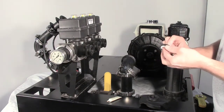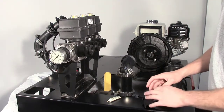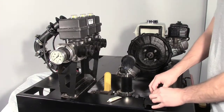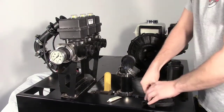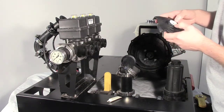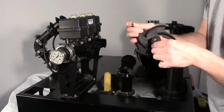Press the seal half into the hub of the impeller using even force. Be absolutely sure that the ceramic seal half is bottomed out and installed squarely. If the installation is not square, seal wobble will occur, leading to premature seal failure. Care must be used when handling the seal to not scratch the seal surface.